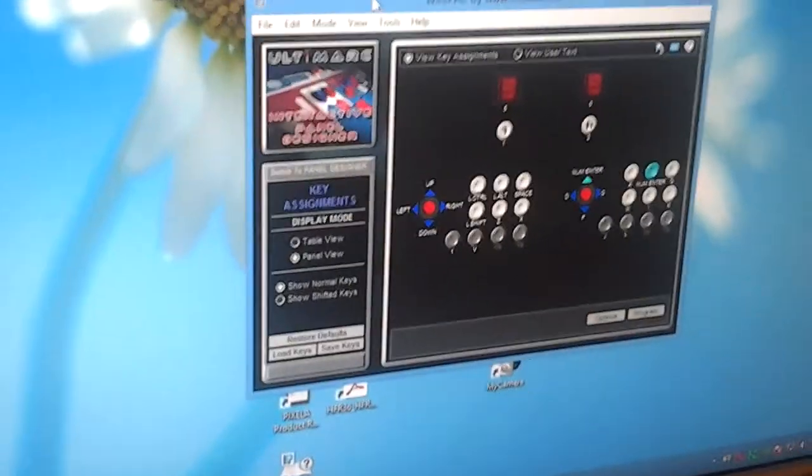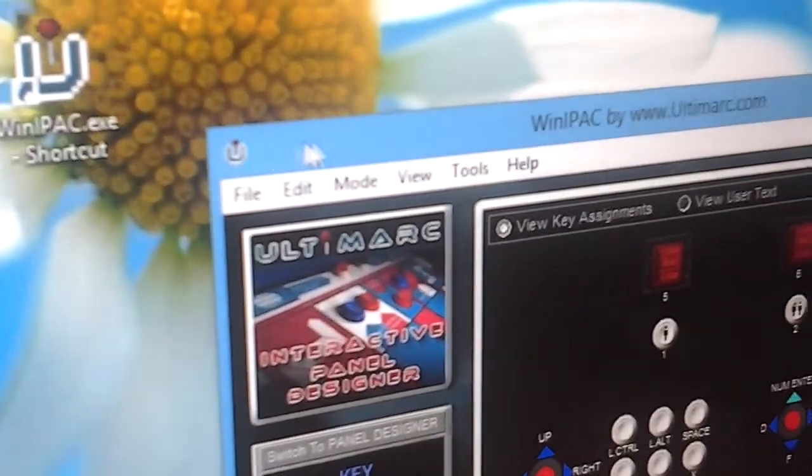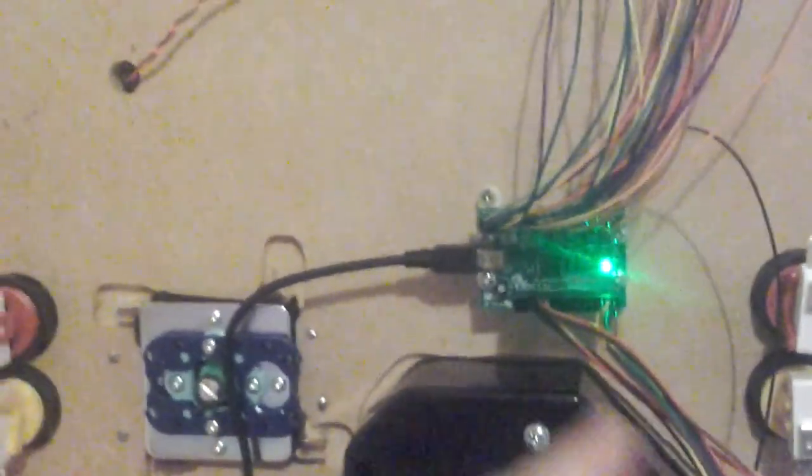And if you look on the screen, I'm just going to move the mouse, if I can get my hand round. Where's the mouse gone? There it is. As you can see, that's a spinner moving. Okay. Now the idea is quite simple really. We wire up each one of these single wires to a button, and we ground each one, and when we press the button it makes the connection, and the iPack, which is programmable, sends a key to the keyboard.